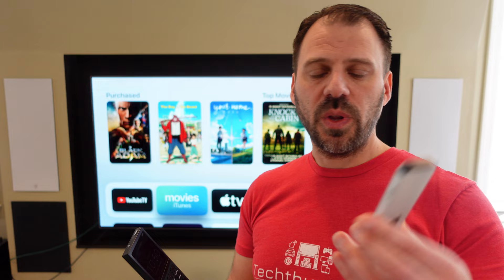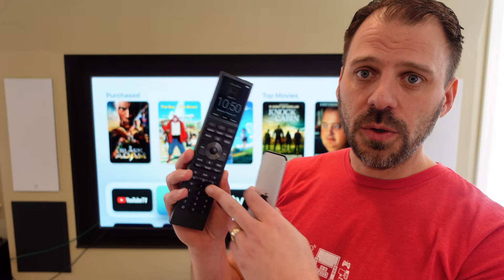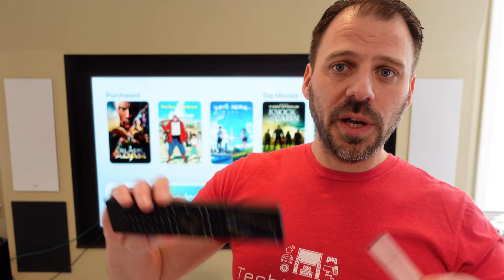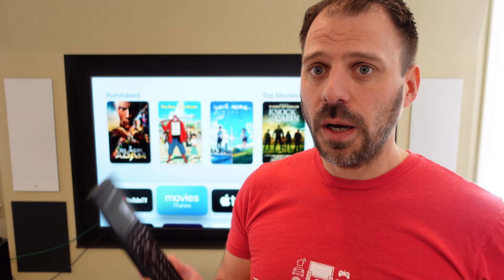Because it's an Apple TV, we have the ability to do almost all playback control via the up, down, left, right, and OK buttons, or using the transport controls. But keep in mind there's no intelligence yet in the new drivers between the Apple TV and the rest of your Control 4 system. I do a lot of cool stuff with Control 4 and Kaleidescape — lights dimming and turning on and off — because those two devices communicate state and information to each other. But from a playback perspective, Apple TV and Control 4 are not yet doing that. I hope that comes with future driver improvements. You can still get at least a little bit of coincidental intelligence using play, pause, and stop triggers in Home Composer where you can add programming.